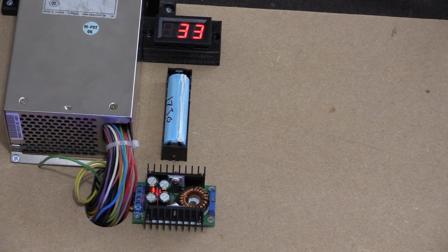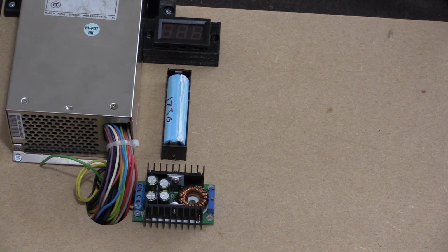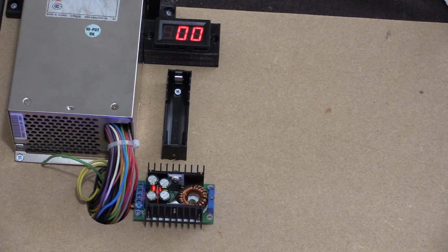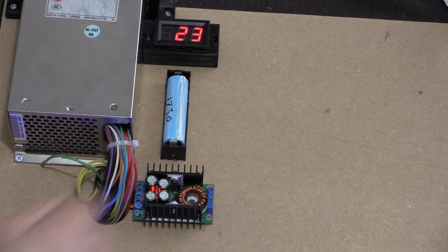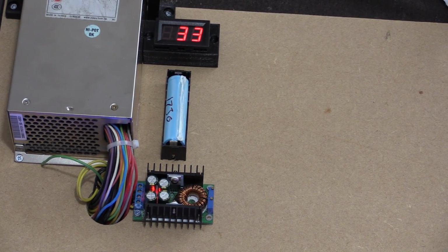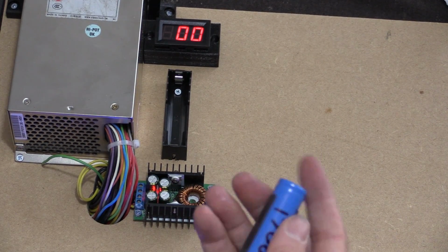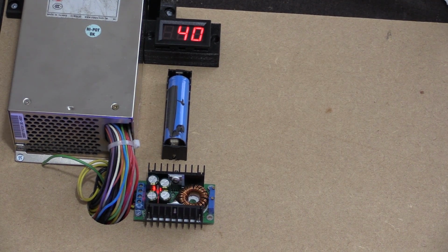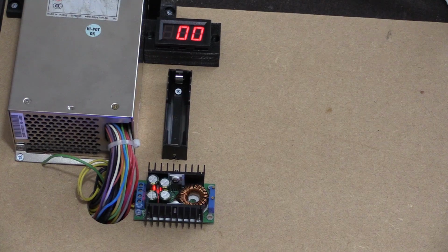Right, so that's how it looks now that the multimeter is in place. So if I turn that off, the cell can be easily taken in and out. I'll put the cell in. Beauty. Now I can check the cells. For example, this one here won't charge. The reason it won't charge is because it's actually sitting at around the 4 volt mark. So that works flawlessly. Charging.